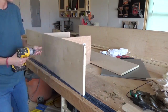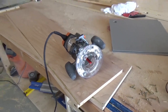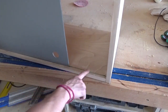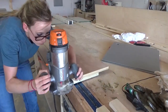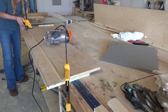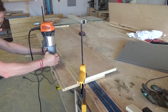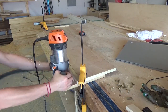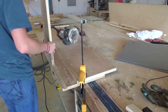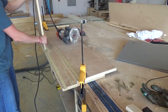Once I had all the pieces of the cabinet taken apart, I used my Ridgid half-inch router and a Diablo half-inch straight bit to cut out the slot for the doors. Since I already had a quarter-inch slot in the top and bottom pieces of the cabinet for the previous quarter-inch plywood doors, I lined up a straight edge so that my half-inch bit would run right along next to that slot and cut the same depth to make a three-quarter-inch total slot. Once I had my slot cut, I test fit a piece of three-quarter-inch plywood scrap just to make sure that it fit. I wanted a good tight fit, but also loose enough to easily slide back and forth.